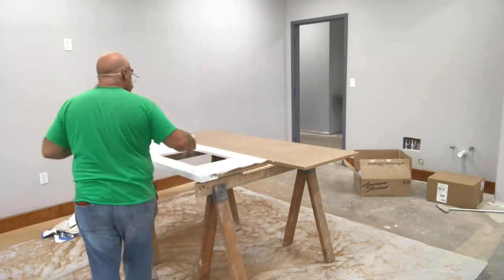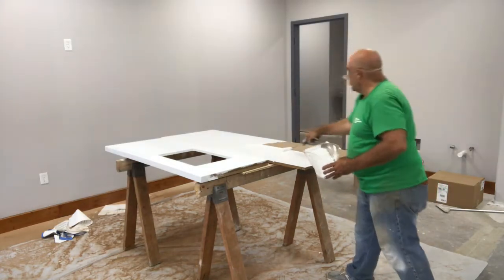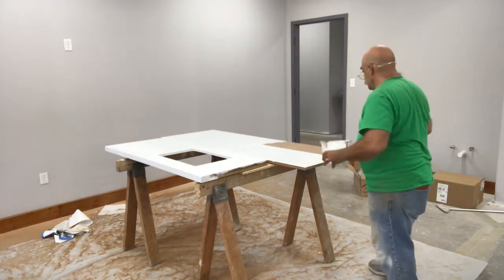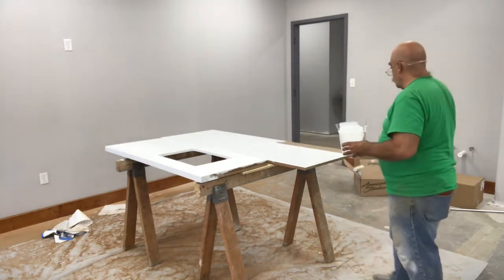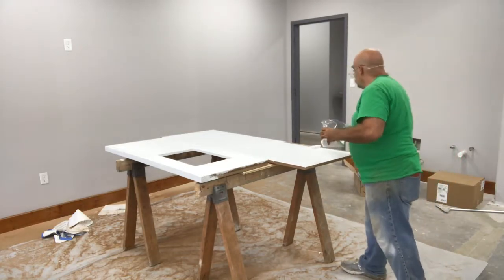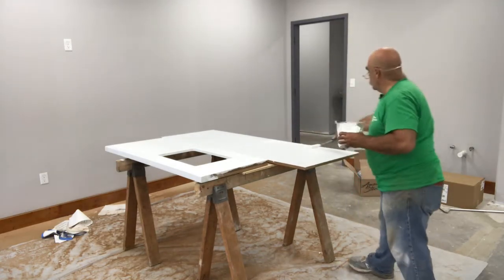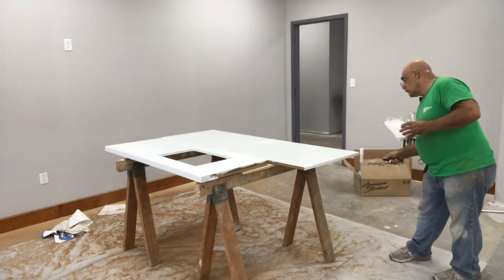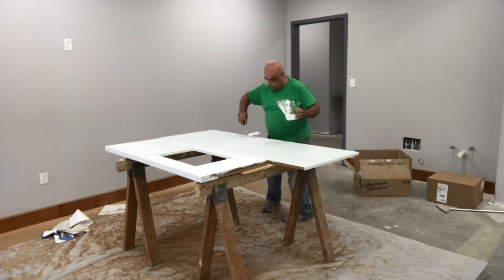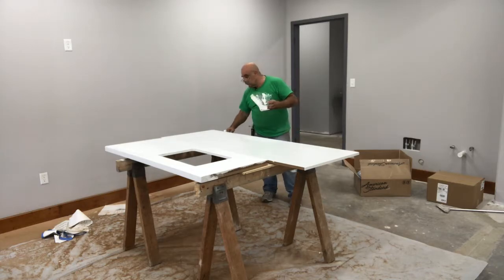I'm building a couple tops at the same time. This top is just going to be a flat top. I built up the one that's going to have an undermount sink, but the flat one I'm just going to use a frame underneath it and the cabinet — I elected to go with just a single sheet. This one's going to be exposed on two sides and the front, so make sure you coat all those edges. When it's dry, hit it with the second coat.